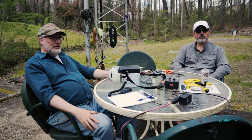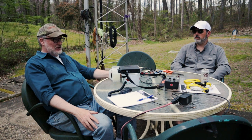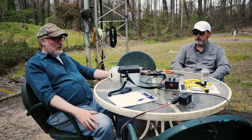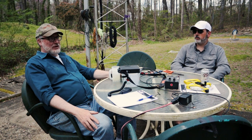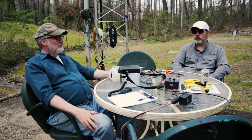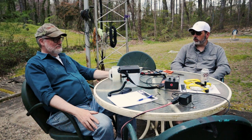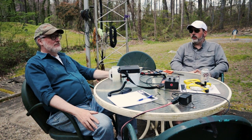We used about 94 feet of number 14 stranded THHN wire. That is available at any home improvement store in the known universe. And it's not expensive. Not at all. A 500 foot roll, which is a whole lot more than you'll need, probably set you back about $40. Just think how many antennas you can make. You could make five antennas out of that for $40. So if you and your buddies want to get together and build one, yes, it's a good way.